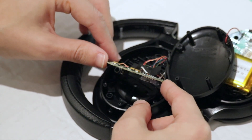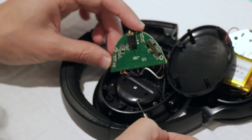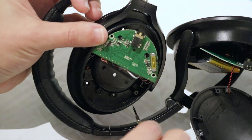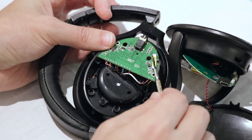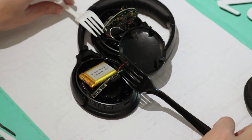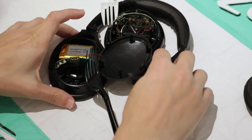Let's peek underneath carefully. When we reassemble we're going to be careful that this gets mounted properly. Inside the case there are two little prongs for where the switch hooks up, so we'll just have to mechanically make sure that lines up. I took two disposable plastic forks, and that will allow me to have good access to conformal coat both sides and let it all dry at once.